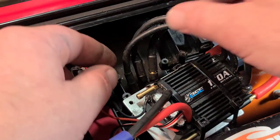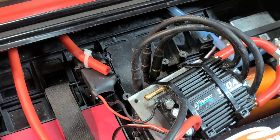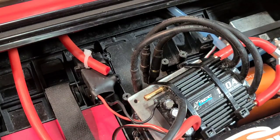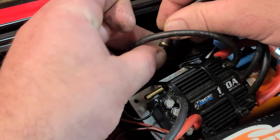I'm going to heat shrink the connections and put a little bit of silicone around the heat shrink to protect from salt water so I don't get corrosion on my connectors — that's a no-no. I'm not even spraying the Corrosion-X, just letting a little bit trickle on there.